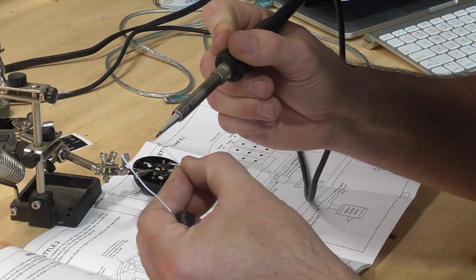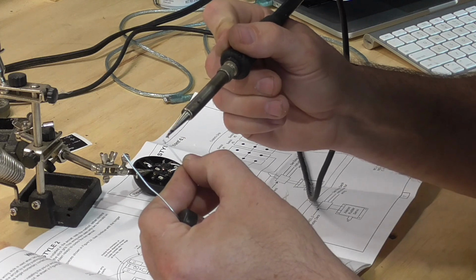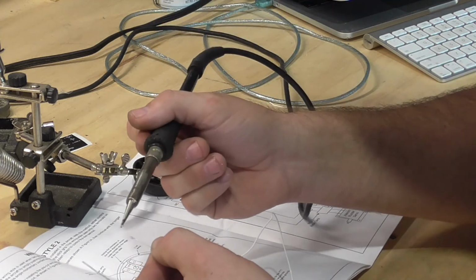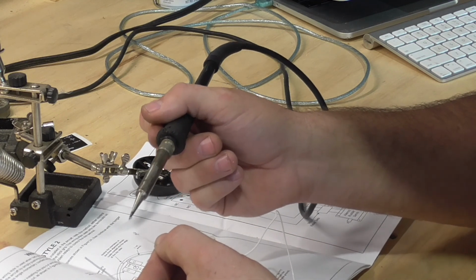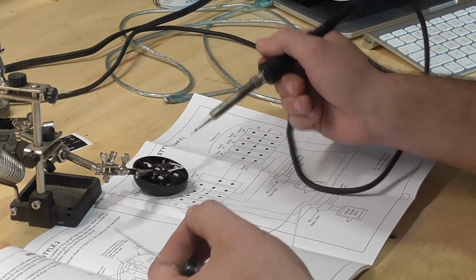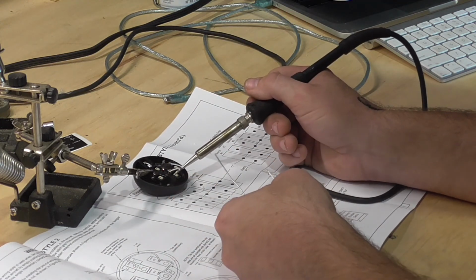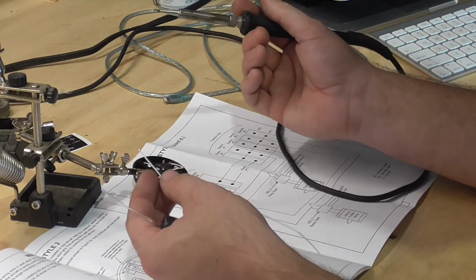This is the way I learned to do it. But you actually pre-tin your wire. That way, whenever you make your solder, it grabs to it easier instead of you pushing on it and trying to get the solder to melt to the wire. It's already on the wire, so the solder on the wire melts to the wire wherever you want your joint. So you pre-tin the wire, then when you press them together and heat them up, boom, it's quick.